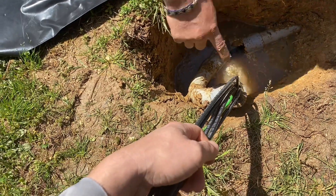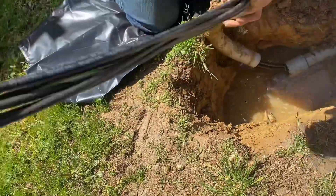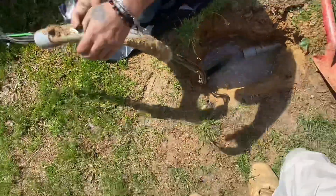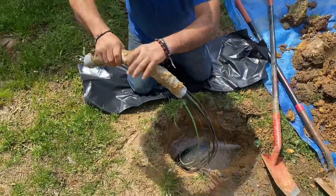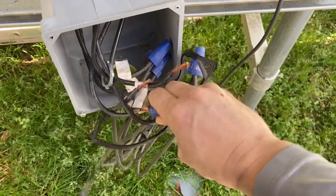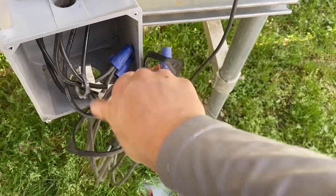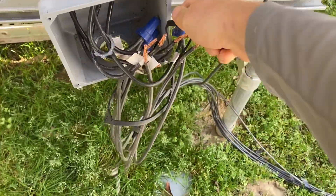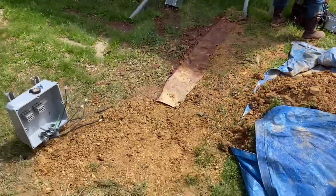Any conduit I've ever found in the ground for any length of time has had water in it — conduits are usually filled with water. THHN/THWN is a wet-rated wire; you could put it in a gas tank if you wanted, so it's totally all right in this application. Just keep in mind stuff is going to fill with water as you're burying your pipes, even if you glue them tight — just condensation in general. And blue wire nuts — you're going to twist them till they're as tight as they can be.